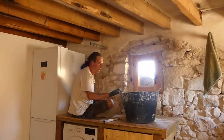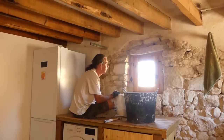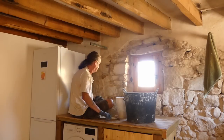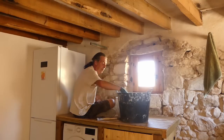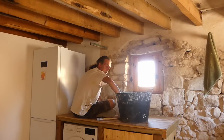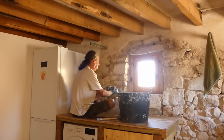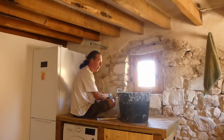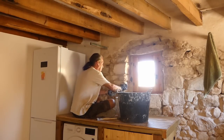So we're off. I've got my bucket of mortar and a bucket of stone. We did have a cat on the window supervisor, but it's gone. I've wet it all down. Just in case you're wondering, I'm using a four to one sand and lime mix. We always use a slightly different one inside than outside - a slightly coarser one outside, but we like this one for inside. So let's crack on.